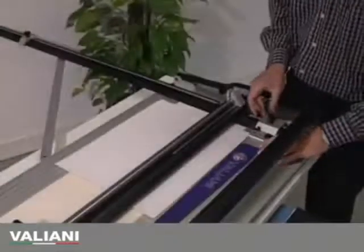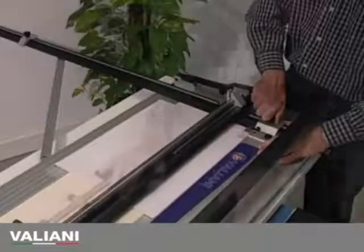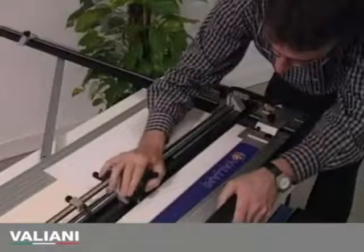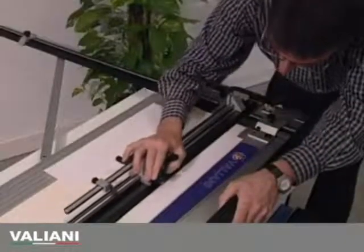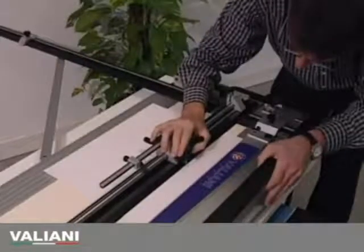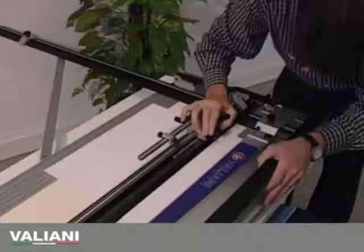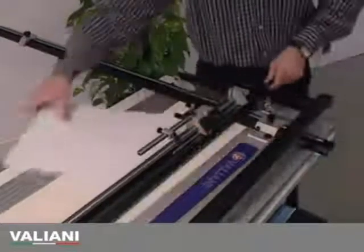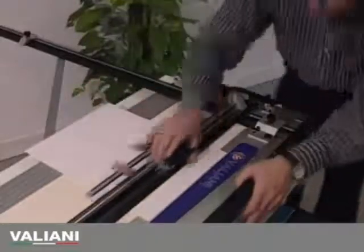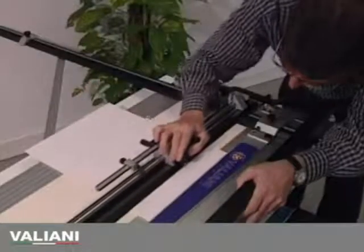For some cuts, you can use the left-hand ruler, which makes it easier. Start cutting 2 millimeters, 1/16 of an inch, before crossing the pencil line, and stop cutting 2 millimeters, 1/16 of an inch behind the next crossing pencil line. Continue this way for all of the external cuts. When the 4 external cuts are made, remove the left-hand ruler.